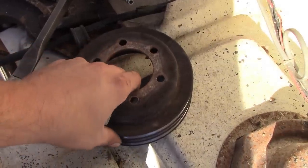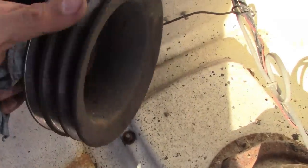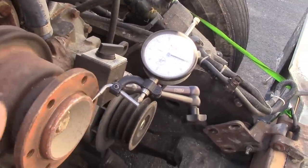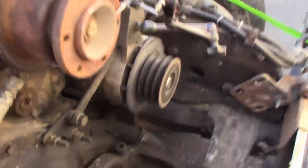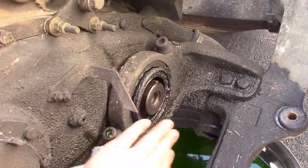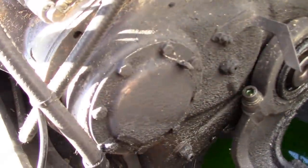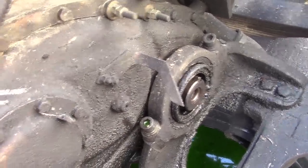There's something wonky about these drive pulleys. This is the water pump pulley, and the one down on the damper is the same way — I think they're just bent. These are fabricated pulleys, stamped out of sheet metal. But just to be sure, I wanted to check the runout on the water pump flange, and it looks good — it's within a few thousandths. So we're going to try to find a new pulley, and I went ahead and pulled the whole damper off the front. You can take the pulley off without taking the snout out of the crankshaft, but obviously the front main seal has been leaking, so we're going to replace that while we're here. I also ordered a timing cover gasket set.